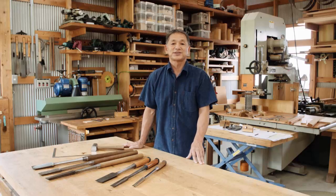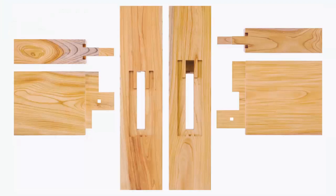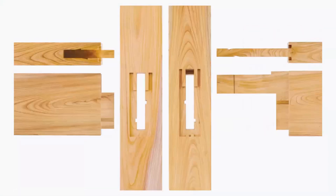Today I will make a model of a quadruple plug joint. Typically, in a quadruple plug joint, tenons are inserted into one point from all four directions and further secured from slipping out. This makes the cross-sectional size of the mortise quite large. We use large pillars so that even when we cut large mortises to allow beams to be inserted from all four sides, this does not compromise the pillar's strength.